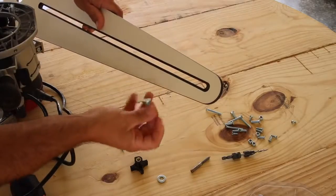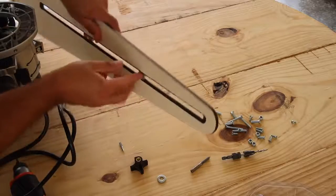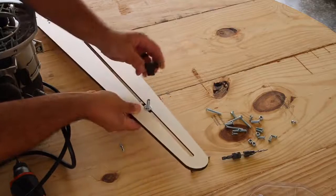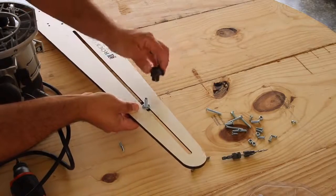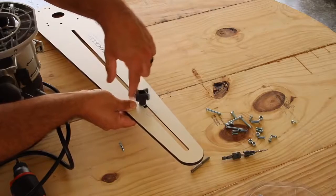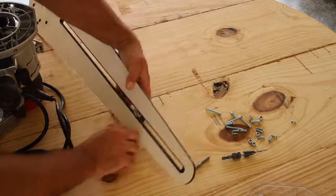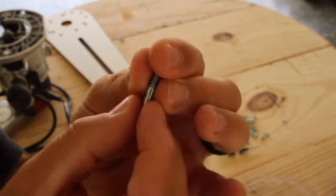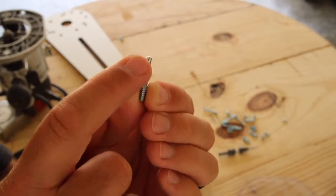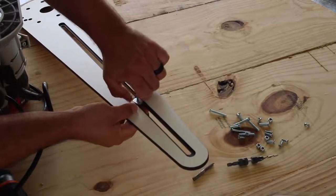For the other end of the jig, it's pretty simple. There's a t-bolt that slips into a slot with a little track so it can slide back and forth. We add a washer and a star knob — the star knob is what holds it in place, locking and tightening it down to the jig. The underside of the t-bolt has a threaded insert where you can add a few different options, but in this case we're looking at a little pin. One side of the pin has threads to go into the t-bolt, the other side is a rounded pin that slides into a pre-drilled hole in the center of what you're cutting.